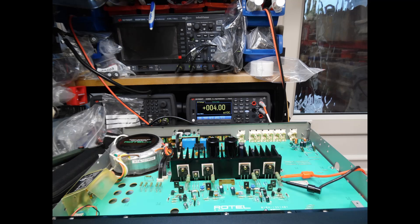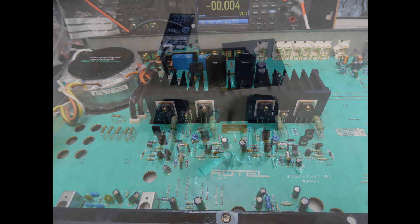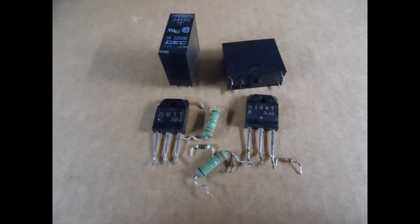This amplifier had been in a very good environment, so for the tone selection switch and input selection switch it was just a matter of cleaning with DeoxIT — no reason to remove them from the circuit board for a complete strip down. Here at the top of the amplifier after completion of all work, you can see the new blue speaker protection relays installed at the back, the two repaired channels, and where the conductive glue was removed from the low voltage power supply area. Here are all the components removed: the old speaker protection relays, the two failed output transistors, emitter resistors, zener diodes, and the small 220-ohm quarter-watt resistor.